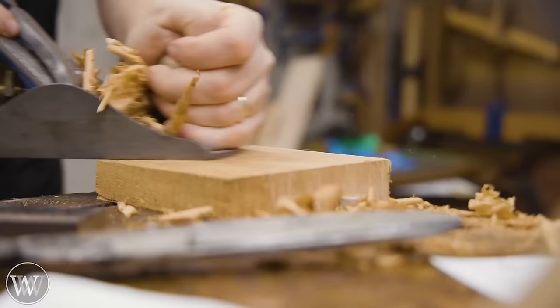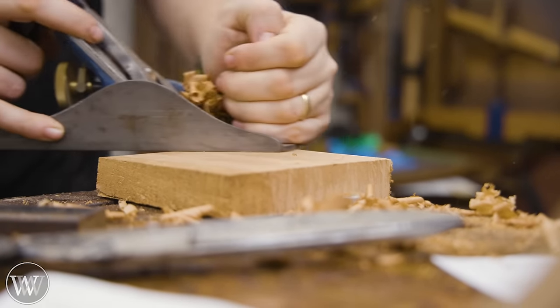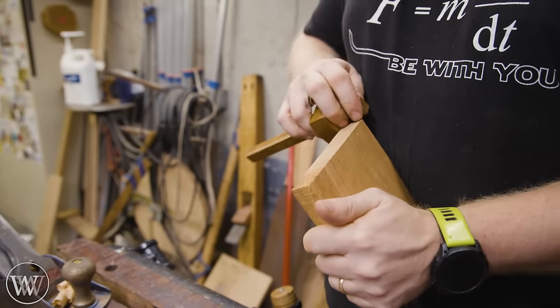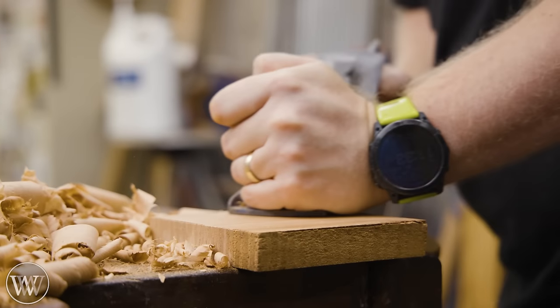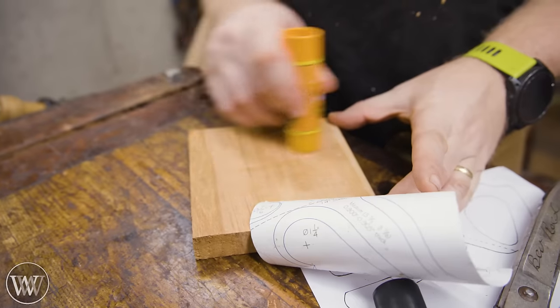It's a little thicker than it needs to be, so I'm going to plane one side down, use that as my reference face, then mark off to the other side and plane the other side down to match it. I like my handles to be just a little bit fatter than 7/8 of an inch thick — I find that to be very comfortable. Some people like it around three-quarter, some people like it up to about an inch.